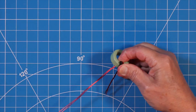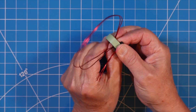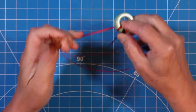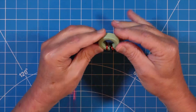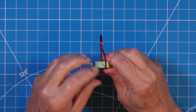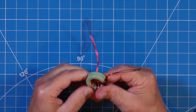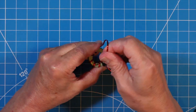You're going to have enough of a struggle here as it is. If you do these every day or once a week you become very proficient at it; if you do this once every six months, every time it's a new challenge. Don't take that to mean this is impossible — it absolutely is not. You can do this, just go slow. Every time you complete a wrap, step back and look at what you've completed. You need to be asking yourself: I have to wrap this eight times — am I getting them evenly spaced so when I'm done the leads are going to be where I want them? Just visualize it. Do not cross over your wires. Watch as you insert the wires down the core, look down the core as you pull them tight. When you get around to the other side and you have eight wraps, everything will be exactly in the place it needs to be. Take your time, check as you go. You can do this.